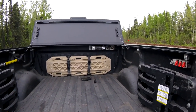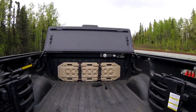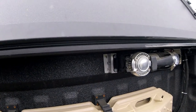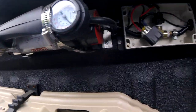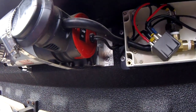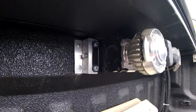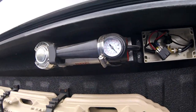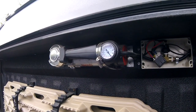As far as recommendations and things I would do differently — first and foremost, I would get an air compressor that has good mounting holes. This one mounts well on the left side, but on the right side it's kind of plastic, which makes it super hard to mount. I had to build a riser using right-angle aluminum and use a hose clamp just to keep everything in place, because my old mounting method kept breaking. It's not ideal, but it's been working for a long time with no complaints on performance.